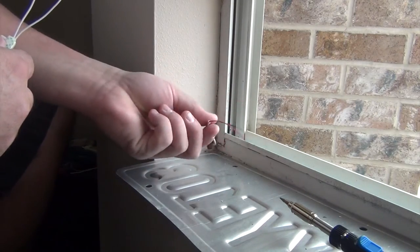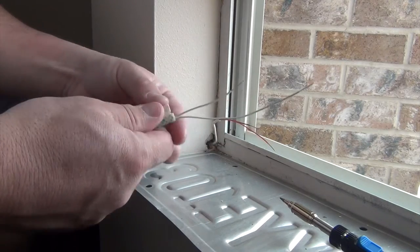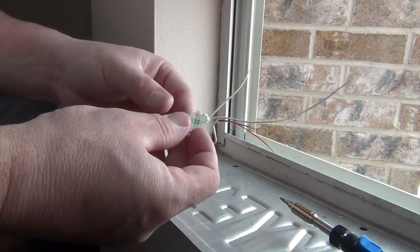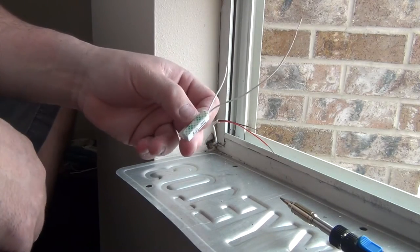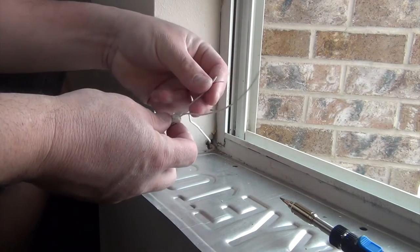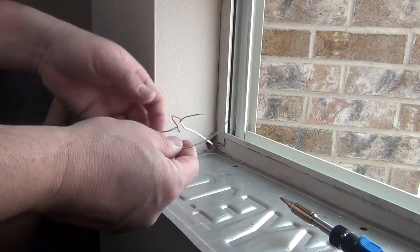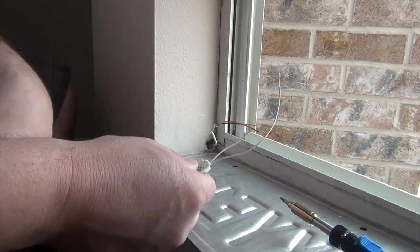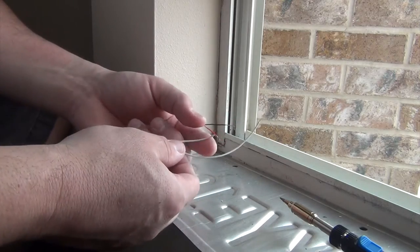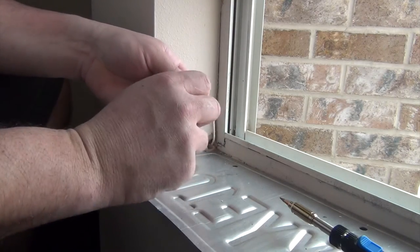This is how we were doing it back when I was doing housing complexes. I strip the wires so they are two different lengths — my first wire is about two inches long, the next wire is about two inches longer than that. I do the same thing to my contact: one short one and one long one. The first thing I do is take my short wire and go to my long wire and twist them together. Then my long contact wire goes to my short window wire. It doesn't matter which color because this is just a contact — a dumb wire, like a light switch.